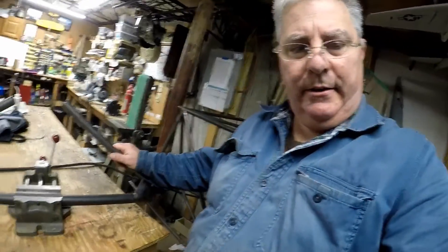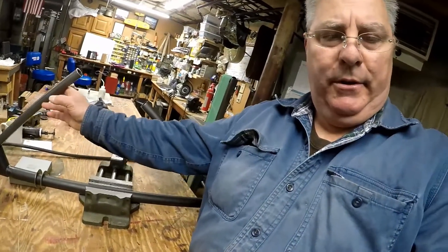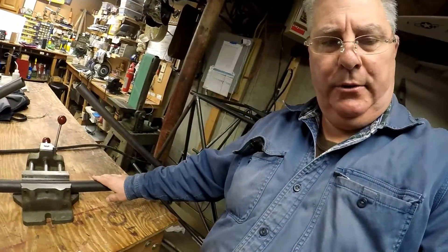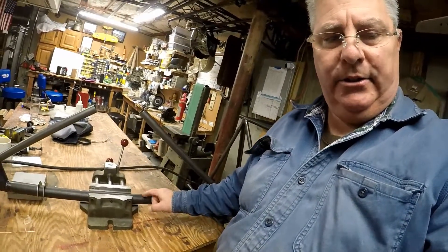Hi guys, my name is Doug, welcome back to the shop. Just a quick video — sorry for the handheld camera — but I've got to turn a radius on a control rod end for the Hatz biplane. The whole control mechanism is right here: we've got the front stick, the rear stick, and the torque tube in the middle. I'm machining the rod that connects both sticks and rides in the center. We're going to do that on the mill — I'll show you the setup, and if you've got the equipment it's a pretty easy way to turn a radius.